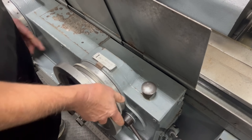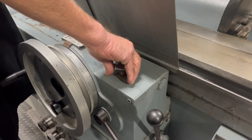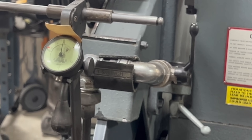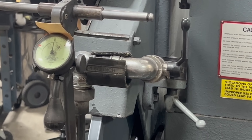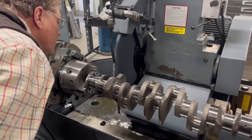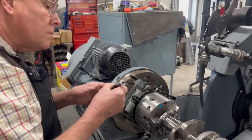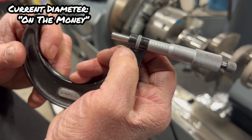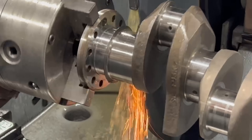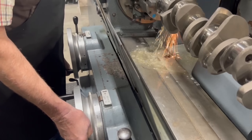Mark that over to four. As we approach the final diameter, the last feeding of the grinding stone is done with the button as opposed to the hand wheel, allowing for two-tenths increment adjustments. I'm going to quit just a little bit early to allow for polishing. Looks nice. You're thinking that's right on the money. So I'm going to kind of sweep as I do that. The width of the grinding stone was just wide enough to grind part of the oil slinger away, leaving a somewhat nasty edge on the OD, which we opted to take down a little bit before calling it quits.